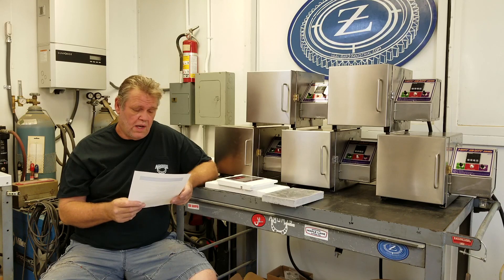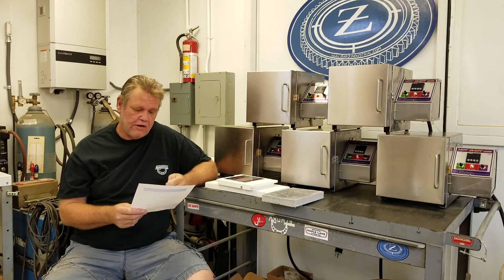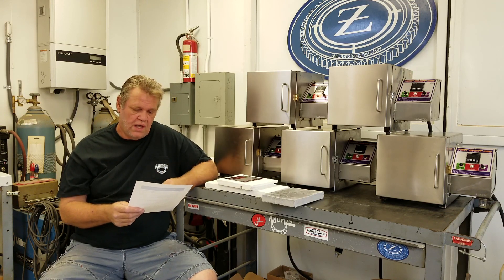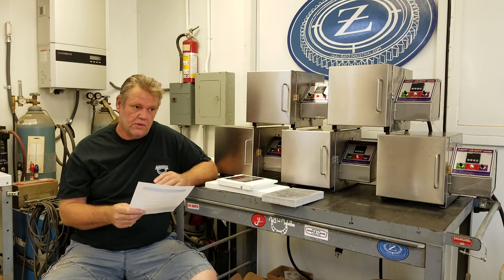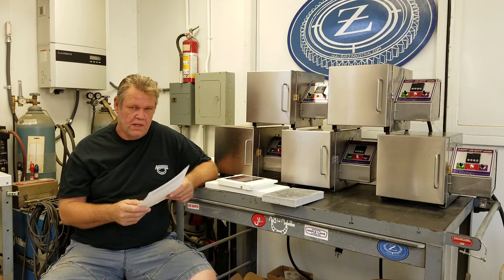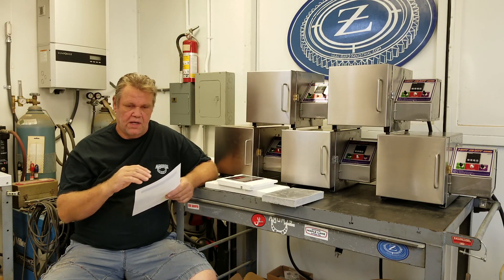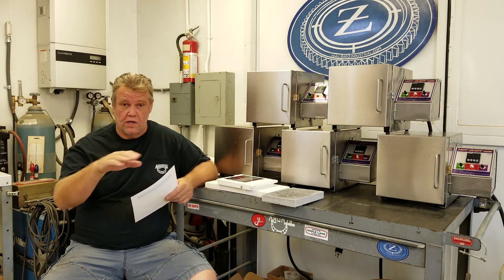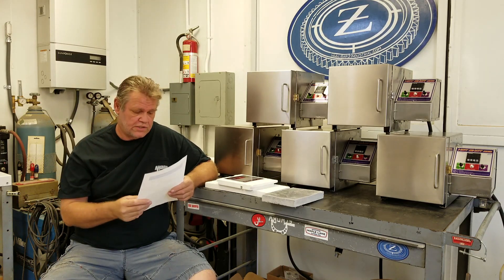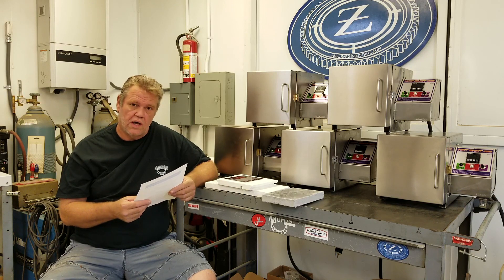For the electrical features: it uses a Novus temperature controller, model number IN-1030, capable of Fahrenheit or centigrade. It has a dual display showing set point and actual temperature in tandem. It's a single process timer — it does have a timer but won't do ramps and soaks. It uses an IDEC SSR, 50 amp rated.